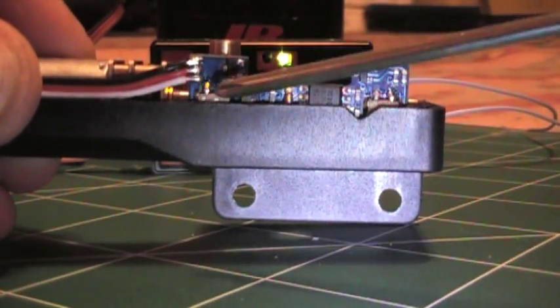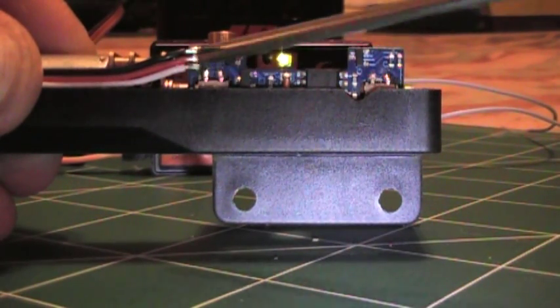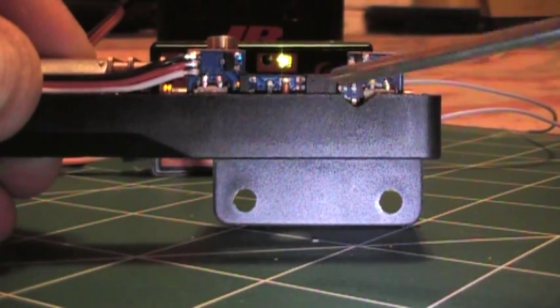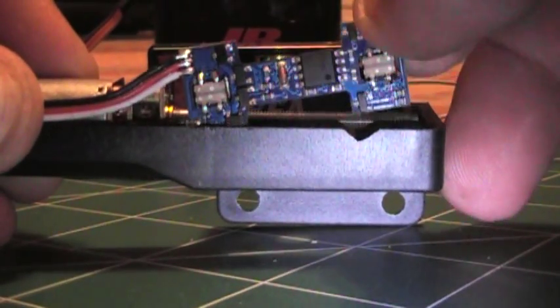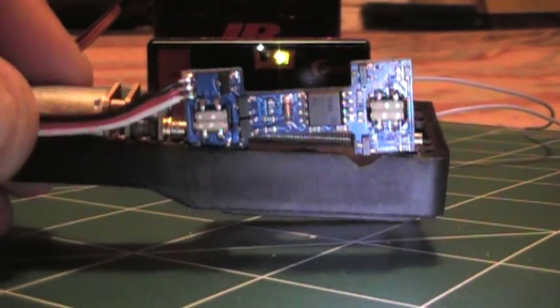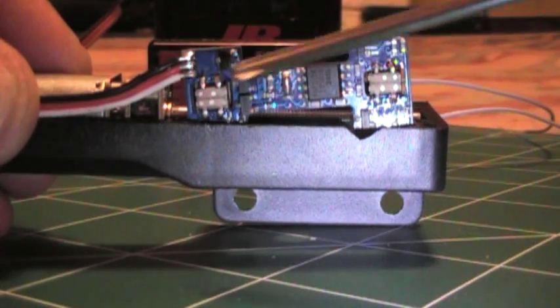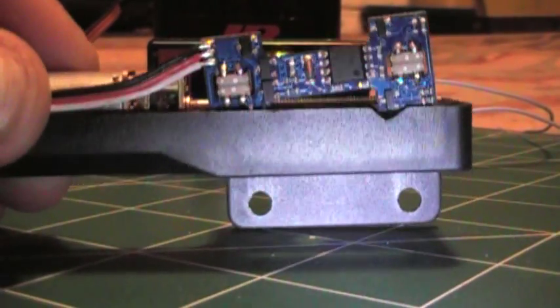electronics and inspecting stuff, but this one's a lot cleaner, even though it's still under a power microscope. You can still find poor solder joints in here and some solder splashes. Okay. Both the two new ones I got there, I've sent FMS pictures, actually zoomed in close-up pictures of the burnt components. I just posted those pictures up on RC Groups, and you can see the same components.